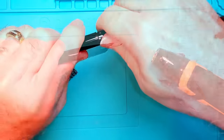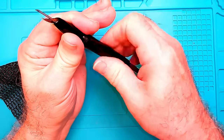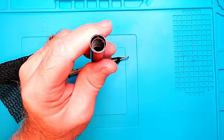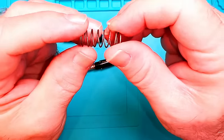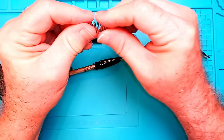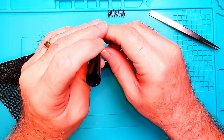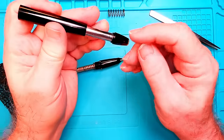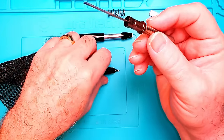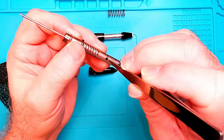That's all the heat it took. There are a lot of threads — there we go. So there's the spring on the inside. I'll probably polish that up and put it in the bath to clean it up because it looks a little rusty, but it still works nicely. Sometimes that spring might need to be replaced and you can get replacement springs. There's a slot screw at the bottom of that barrel that holds the blind cap on, and here is the sack protector — and it came out easy.